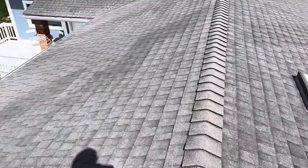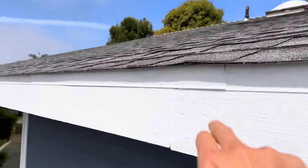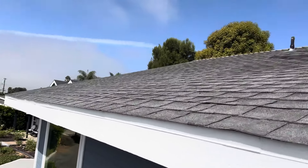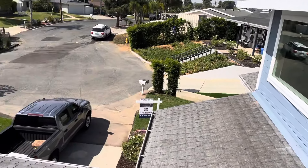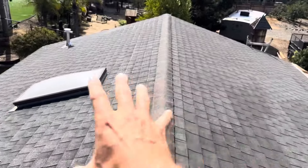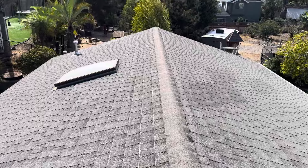Brand new synthetic underlayment with a 50-year warranty. We're going to go ahead and add starter shingle along the entire perimeter of the roof. We will then install the drip edge — this piece of metal right here. This drip edge allows water to run off the metal itself as opposed to running down the wood, which will help protect this wood in the future. So brand new drip edge, and then the actual roofing shingle goes right on top of that. The Owens Corning roof will come with a 50-year warranty. We're also going to increase the exhaust ventilation on this roof — I want to add at least a couple of exhaust vents on this side and on this roof plane as well, just to increase airflow and help keep the roof nice and cool.